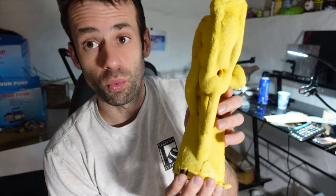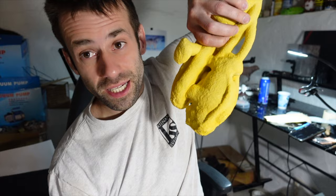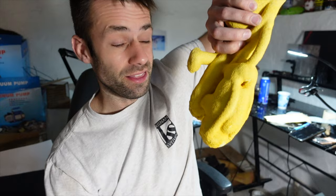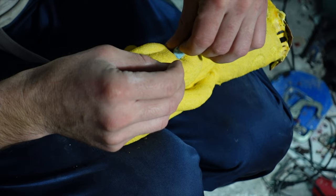One of the things I see happening is the hole that I have here is starting to close in. I cut the hole in there so the slurry can get inside, but what I don't want to have happen is seal off this hole and have the slurry not be able to dry inside there. Because then when I heat it up, I fear it's going to crack. For now, I think I'm going to plug the hole and hope that it's thick enough inside — this paper towel will work as a plug. And then I'll just keep dipping.